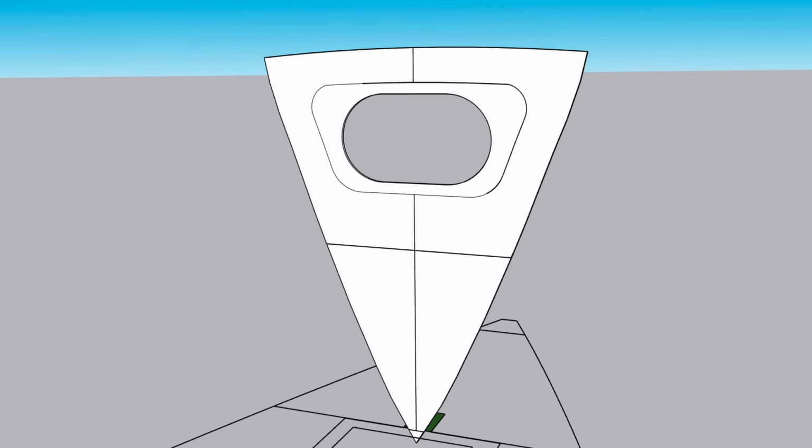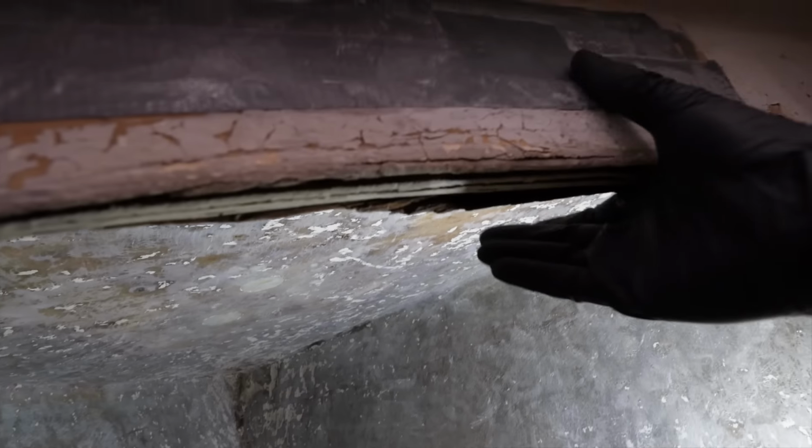There was a 3/4 inch plywood bulkhead, you'll remember, with a huge hole in it that was this really odd shape. The staysail forces were pulling on that and it was causing it to delaminate and open up, and it just was clearly not up to the task.